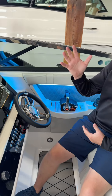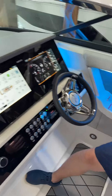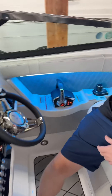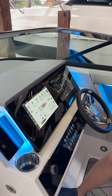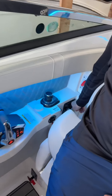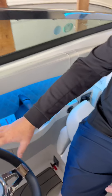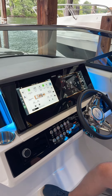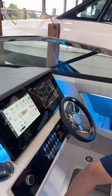To start, the ignitions are on right now in this boat, so it will not allow anything to function back there. So the first thing to do is turn the ignition keys off. Varied models will be in different places — some will be at the steering wheel, some will be under the helm — but your ignitions have to be off, whether you have one motor or two. If you have a hydraulic platform, that has to be off as well.